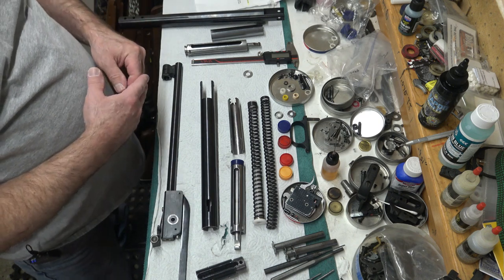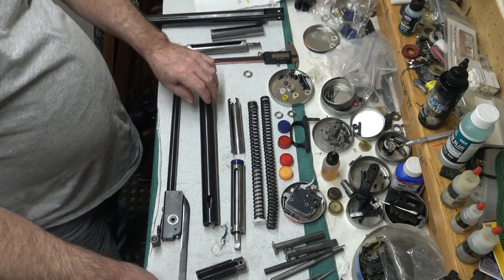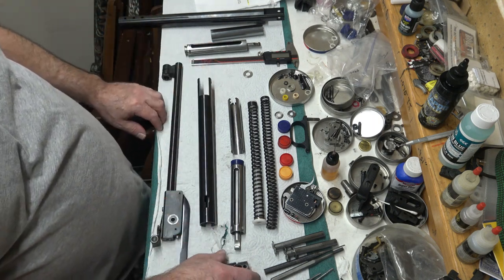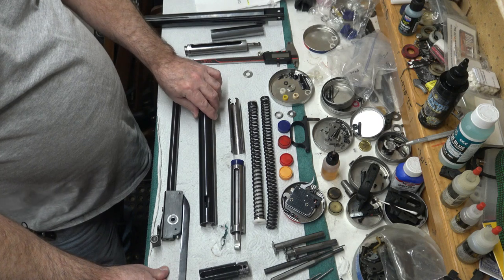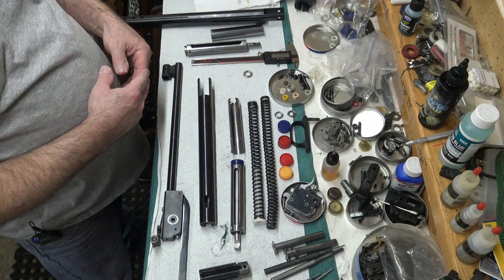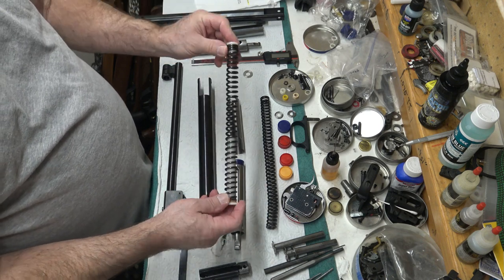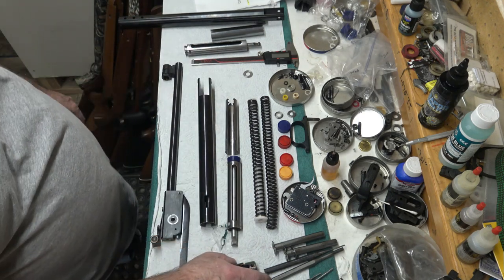For the new guys: one of the things you'll find if you buy a vintage gun is that the air chamber tube sizes vary - that's true of any vintage rifle from Weihrauch. You're going to need to find the piston seal that fits. In this particular build, our piston seal happened to be in between sizes. If you're going to do a custom setup where you make your own custom guides, you'll gravitate towards a Hornet spring from Air Rifle Headquarters.